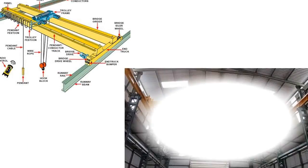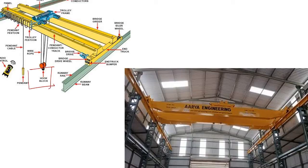These columns need to be designed specifically. When the load attached to the hook is very large, the reaction at the wheel or support is also high, and that reaction is eventually transferred to the column. Where the gantry girder is supported by the columns, those columns have been designed specifically. The bottom portion of the column is heavier and larger in size compared to the upper portion, because it carries the full load attached to the gantry.